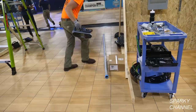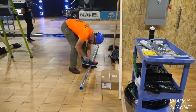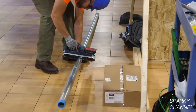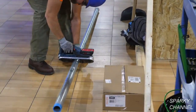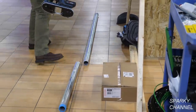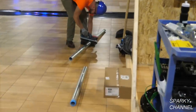And he grabs his bandsaw and watch this. Just put it on your foot like that and cut the 2-inch rigid. For the competition, all circuits and equipment should be correctly grounded and bonded, and all terminals and lugs will need to be torqued down to the correct torque amount. In fact, the competitors will have to write the torque amount used next to each termination within the enclosure.